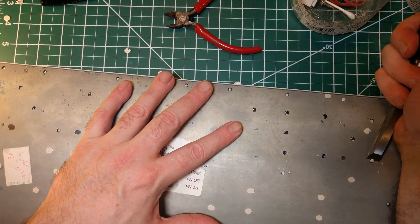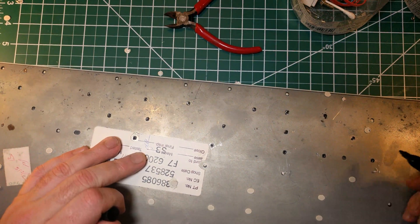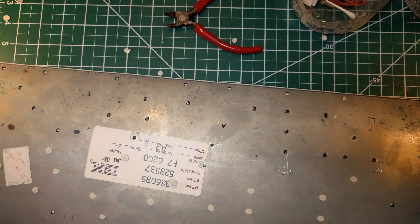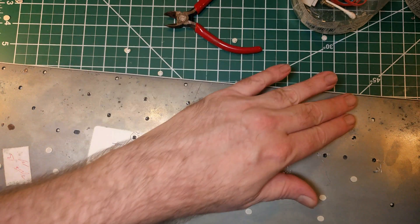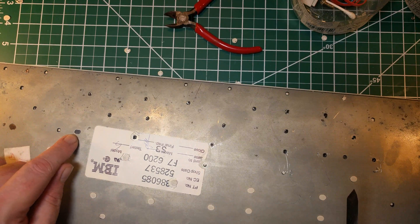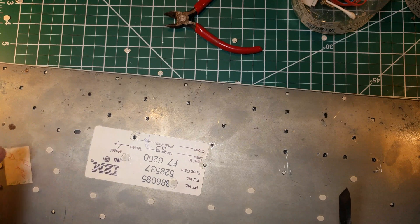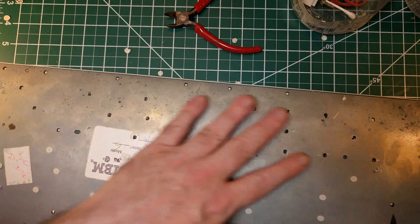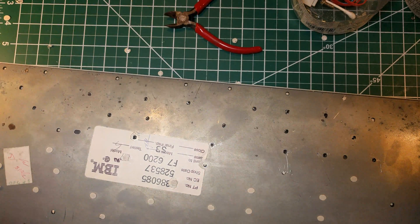What this does is that when you have the backplate off and need to drill holes, it's much easier to know where to drill if you pre-mark them ahead of time. There are holes on this board where there's no corresponding hole in the rubber mat between the base plate and the barrel plate. If you just say 'I'm gonna drill a hole where all the holes on the backplate are,' that's not good enough. You need to pay attention to where all the rivets are that you take off. Sometimes that's tricky because lots of rivets are already missing, but you do your best and mark the ones you can.